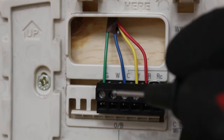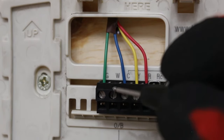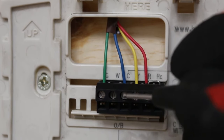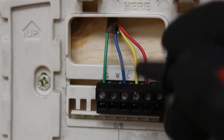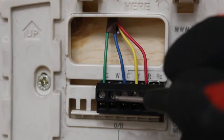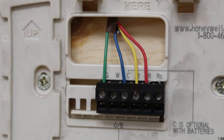Same thing goes for heating. If you put your system on heat, which is your W wire, you're constantly circling voltage between W and C, and at the same time, G is operating. There are different settings on a thermostat whether or not your fan, aka G, starts right away, or if it works off some kind of temperature controller, but this is the principle.